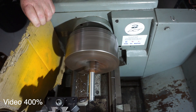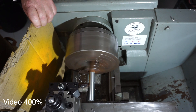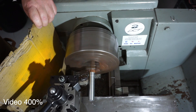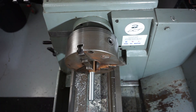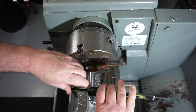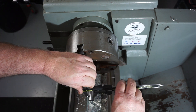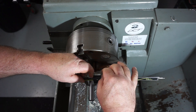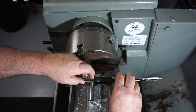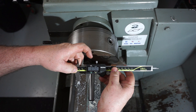The next cut was a little bit deeper, probably about 55 thou. You can see it was chip-breaking really nicely there. I'm just going to check this with the vernier calipers — I'll check it at the front end and also about halfway down and lock the verniers up. You'll see I'm right on the money: 19.05 millimetres, and converting that to Imperial — three quarters of an inch. So I'm happy with that.